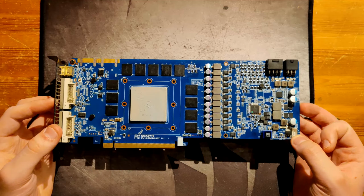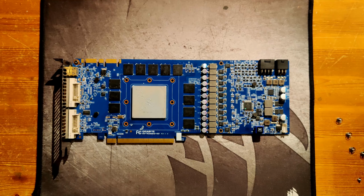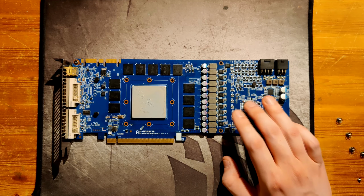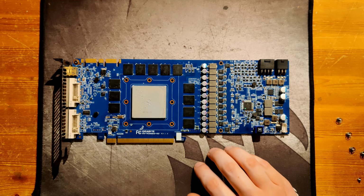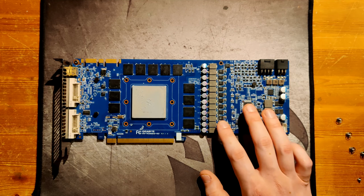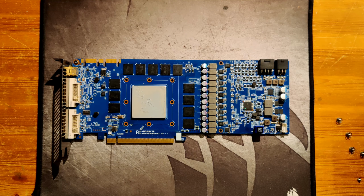So, yeah, we've already crossed 20 minutes, so I think we should come to the end of the video. So, the GTX 580 SO revision 1.0 from Gigabyte. It has a pretty major flaw in its V-Core low-side Mosfets. I do not like what they've done. If this was a revision 2.0 or 3.0, I would probably have a much better opinion of this card, because that one actually has a V-Core VRM that is genuinely very, very great, and it's gonna run everything, whereas with this VRM, every time I run this card, I'm going to be worried that from one second to the next, this will blow up. Which, yeah, that's not a great feeling to have while you're benching something.